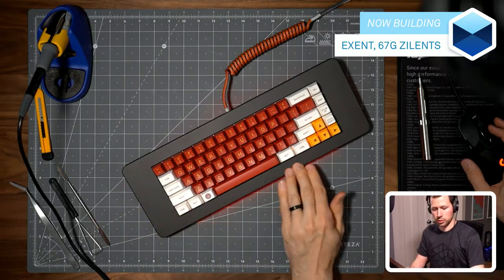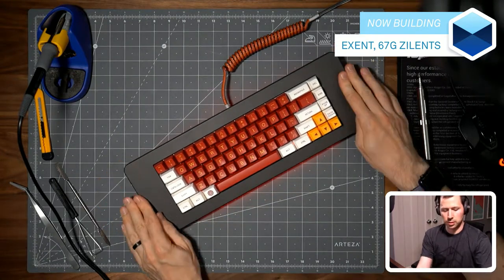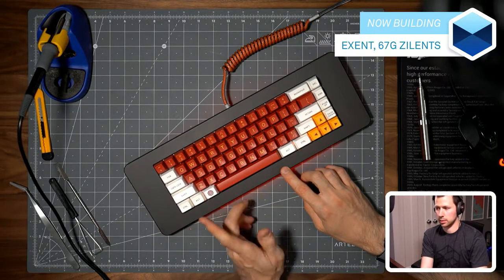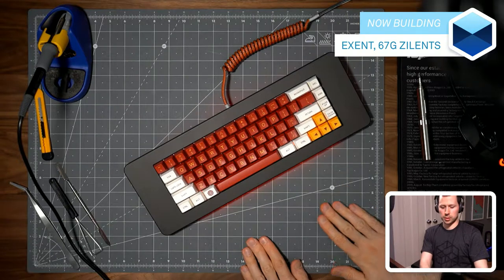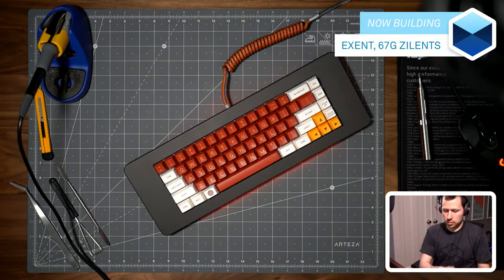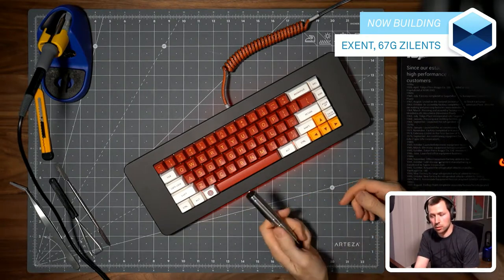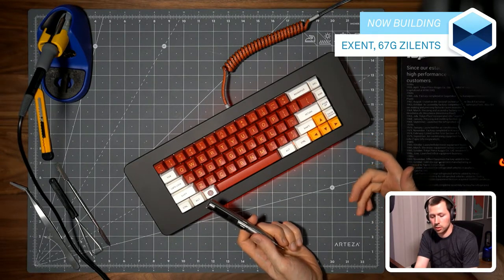Yeah, feels real nice. It's a nice heft to it. Feels extremely stable. I'll try to silence this spacebar, but that's a forever issue with every single build, basically, that the spacebar is the worst part of the build. Yeah, so the screw-in stabilizer is going to be a problem. Definitely going to start switching to nylon washers for all the screw-in stabilizers,